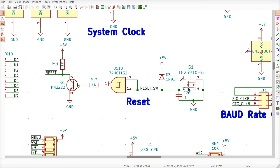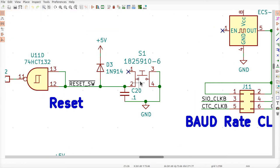What happens when you release this push button, as it slowly physically moves away from the contact points and it's going on, off, is this capacitor starts charging, and then the switch bounces, we call that bounce, and it goes back to ground, and then it charges, goes back to ground. It could happen many, many, many times, okay? While that's just jumping around a little bit, and it cannot fully charge up to the 5 volts over here, that's our Schmitt in action big time, okay?